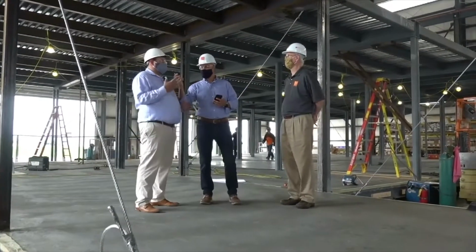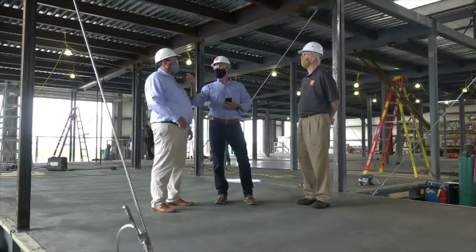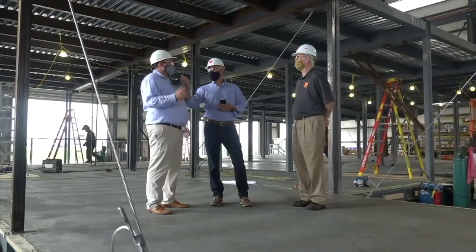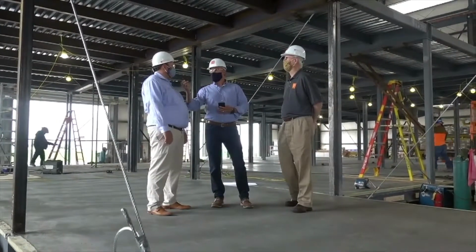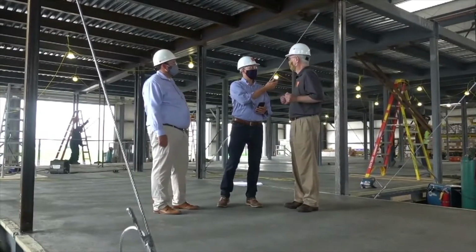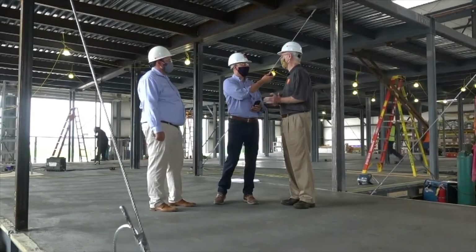So our model is based around steel. We do a majority of steel structures. It helps with fire ratings, helps with transportability, and it helps the build together process, in that we can top pick all these modules, and our tolerances are lower. Yep. And we're also faced a lot of times with multiple larger spans that you could not achieve with wood structures. Right. Sure, absolutely. It gives a definite advantage for that type of architecture.